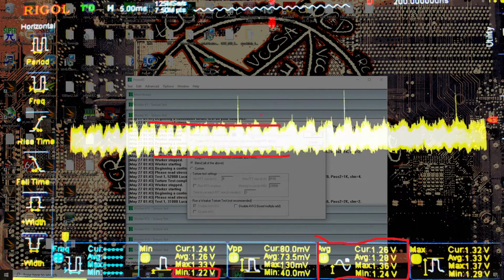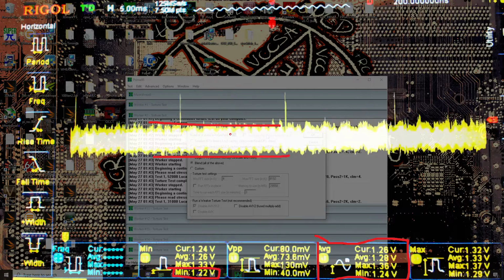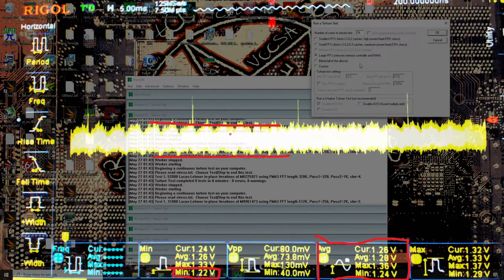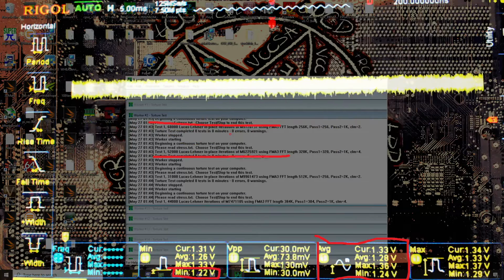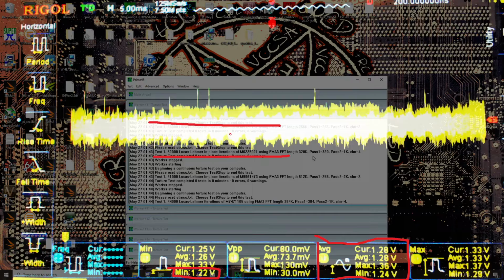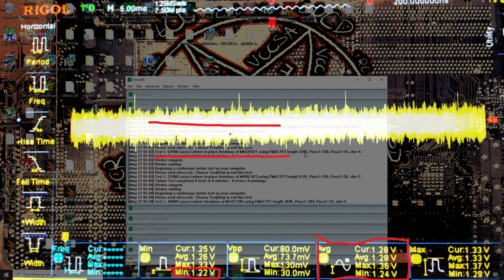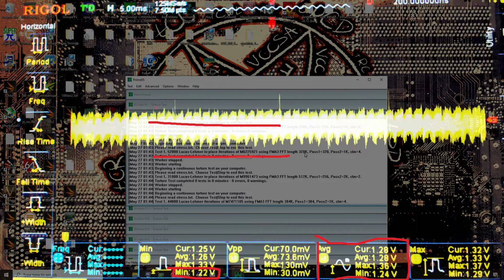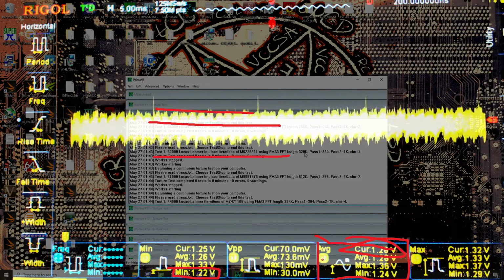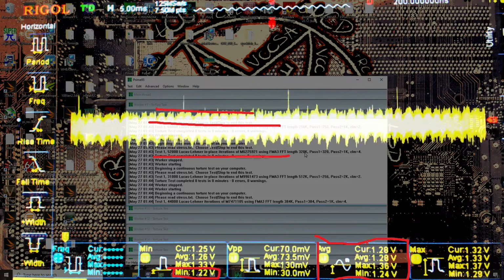Anyway, if you keep cranking up the FFT size, eventually we shouldn't even be able to see the Windows event timer in it. I might just start large FFTs. Also, I can't see anything with this waveform on the screen right now. Let's get this out of the way. Yeah, like large... There we go, large FFTs. And you can almost not tell where the Windows event timer is now. Because this is very, very memory intensive, but consequently our average voltage has just kept going up as I increase the FFT size, because the current draw is lower.